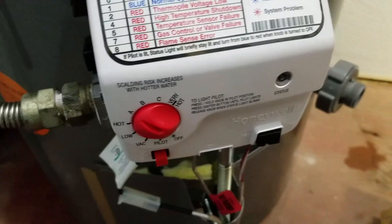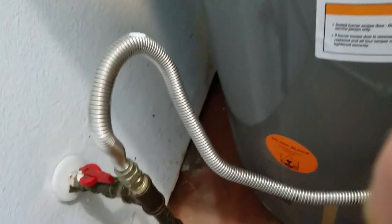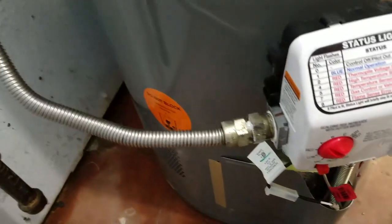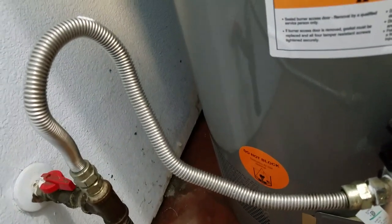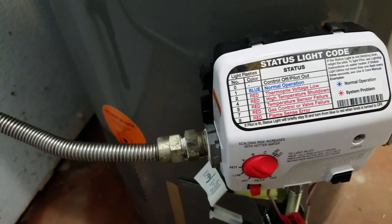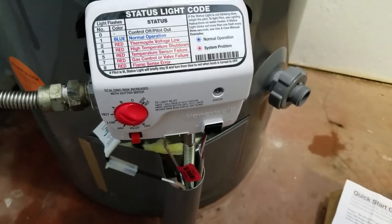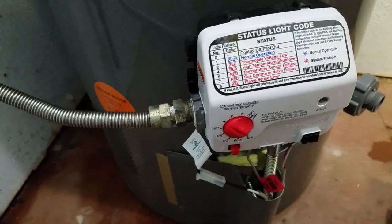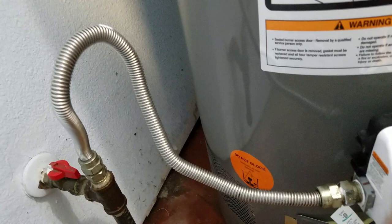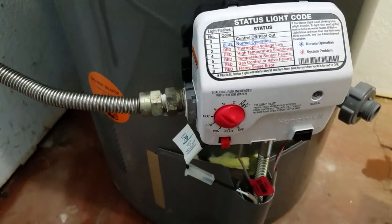No leaks, I can't even smell propane — this is just awesome. If you have a leak you're going to smell it. Between takes when I was doing the bubble test I had the gas on but you couldn't smell anything. So I am reusing this old line and I'll keep an eye on it for the next day or two. I know there are going to be safety sallies out there saying to put a new line on, but like I said at the start of this video, these new lines are made in China and I just don't trust them. This line doesn't move around anyway — the last time it was flexed before today was 1984. So I'm feeling pretty good about it.